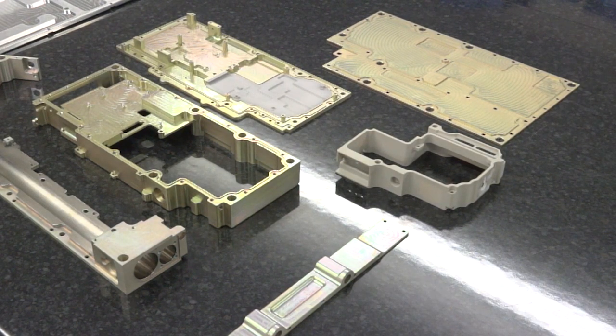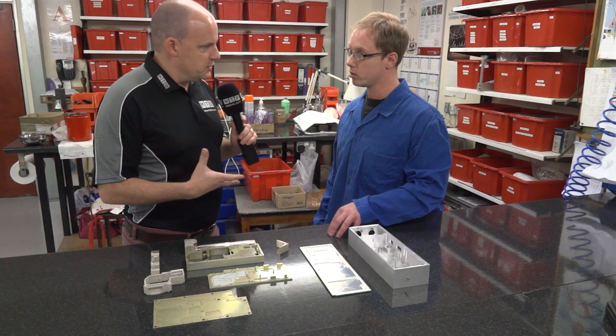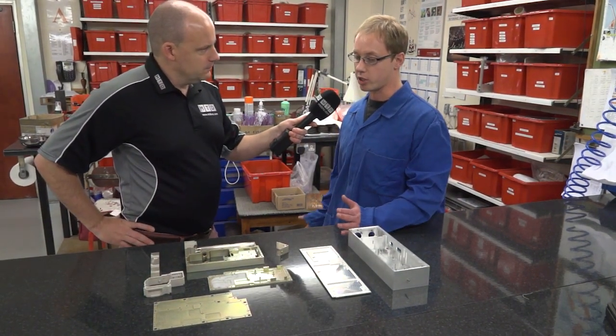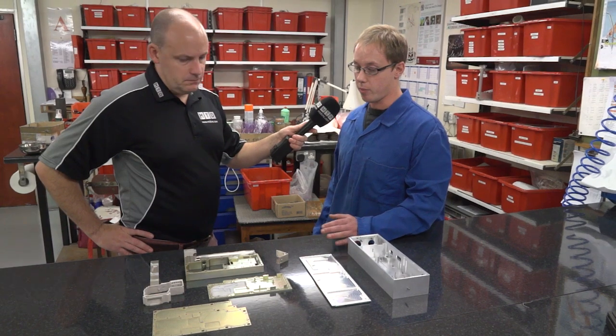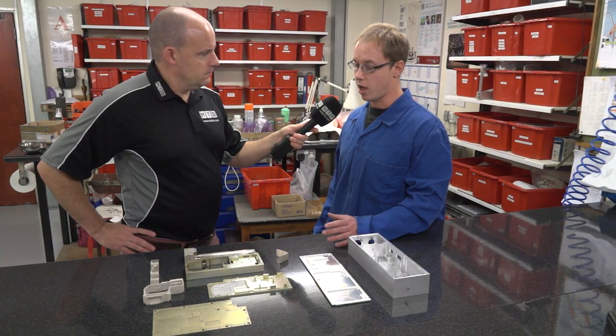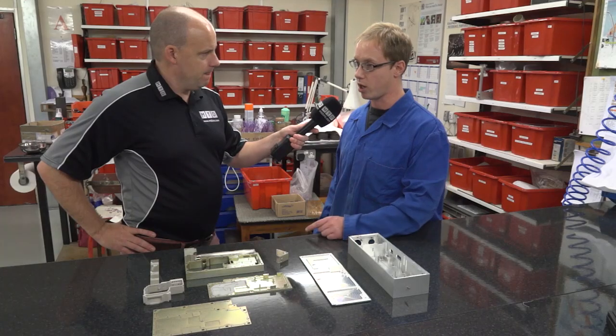One of them is PEEK, which is a plastic part which does get moulded at the end. And what are you machining this to? What have you got when it's all assembled? What are the tolerances? Well, there are all different tolerances on it. Some parts are going to be open. But there are a lot of tight tolerances on heights, on bores, on positions.